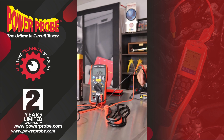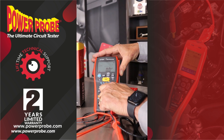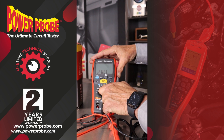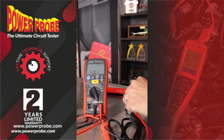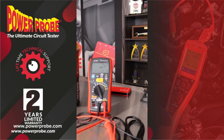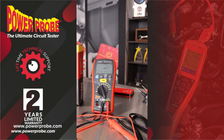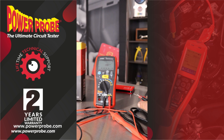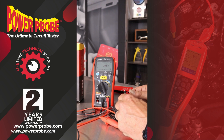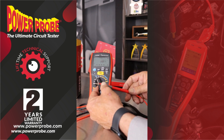It has a mode for checking capacitance, and this is your ohm meter mode, but it's kind of unique — it's not like your standard ohm meter. It runs a little higher current, 200 milliamps, so it stresses the ground connections and stuff that you're usually going to be testing.